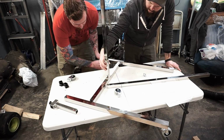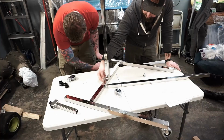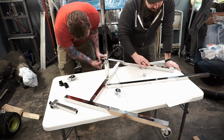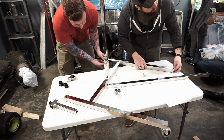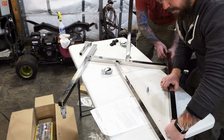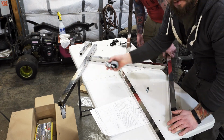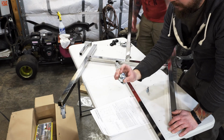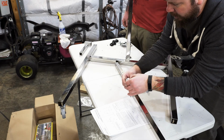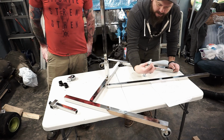The bolts and the acorn nuts go on the main vertical shaft that slides into this T-bracket, or this T-frame. The outside pieces that hold the casters look like nutserts or welded-in threaded bungs on the ends, so the four ends. You just thread your casters right into that. You're just tightening it by hand, then grab a wrench, and you can get final tightness on this, I don't know what you'd call this, is that octagon?